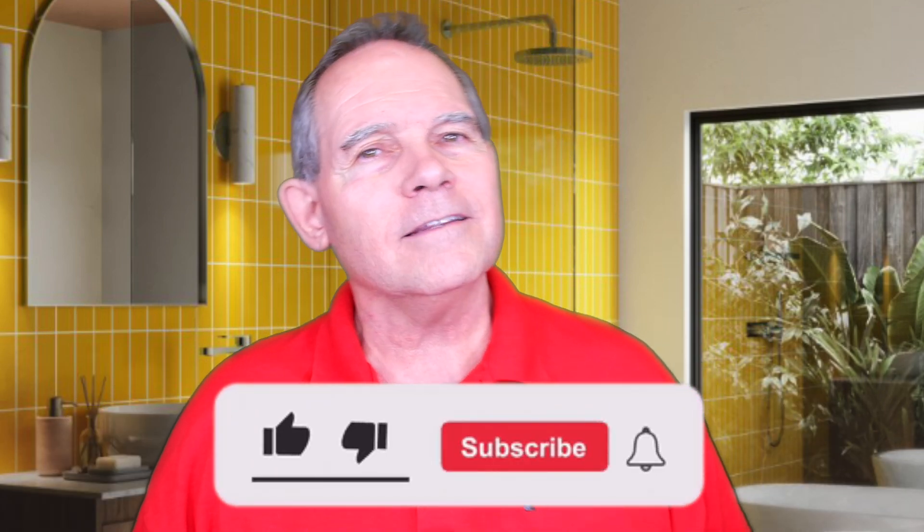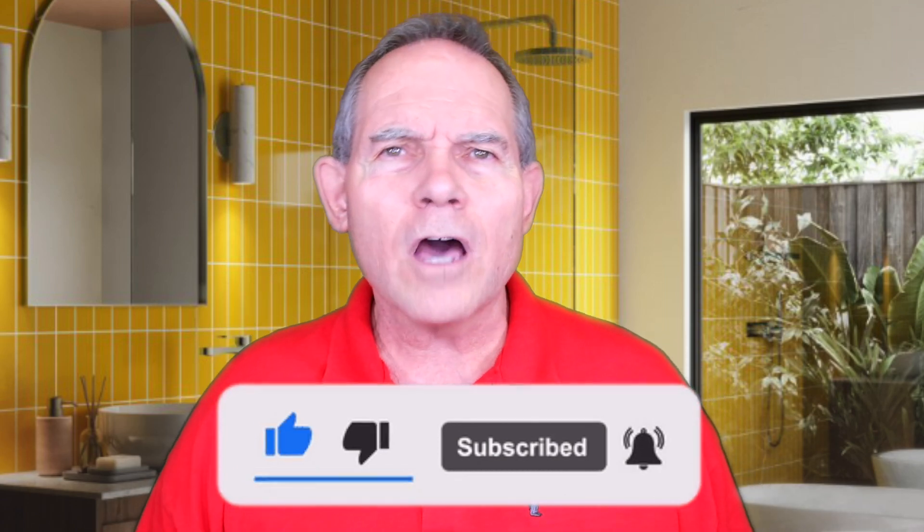I realize this is a brief overview, and some of you may want to add more — absolutely. But I'm trying to give you a basic knowledge of how to use a gas manometer on a tankless water heater and what it's going to tell you. I hope it's been helpful and helped you learn what a manometer is for, why it's important to have one, and the two main things it tells you: static and working pressure, and lastly manifold pressure if needed. Hit that subscribe button, give me a thumbs up if you like this video, let me know your thoughts on how you use the manometer, and remember — the butler did it.